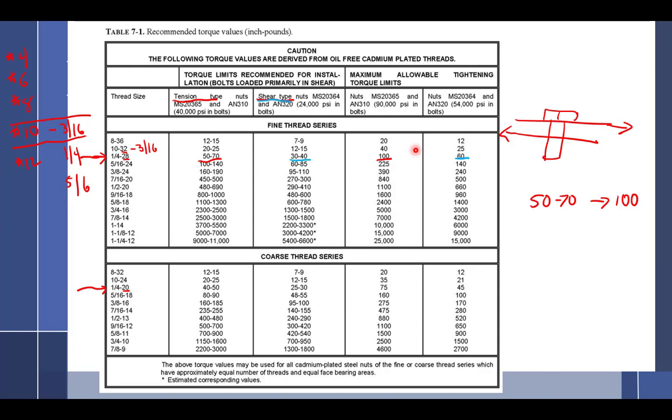I see that often working in aviation. Cylinders are bolted on to engines very differently than a car is. And people will sometimes talk to me and say, hey, what does it mean when I start losing a stud or two out of the engine? It means that your engine wasn't properly torqued. And, well, that takes about 10 minutes to explain what happens. But the engine's failing, basically.